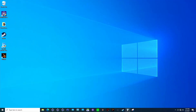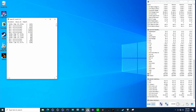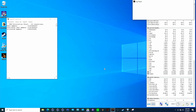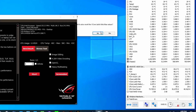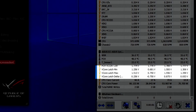In the operating system, do the following. Open HWInfo to log the information. Start SuperPi 32M to run in the background — this ensures there is always at minimum one core active and prevents V-Latch from reporting the minimum voltage when all cores are idle, which would be around 0.6 volts. Run one loop of ROG RealBench, which will take about 9 minutes. When done, export the CSV data into Excel and highlight the relevant information.